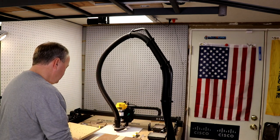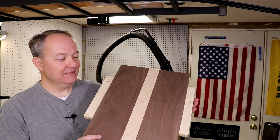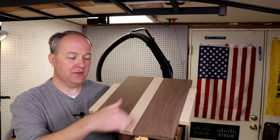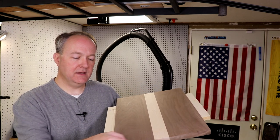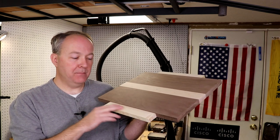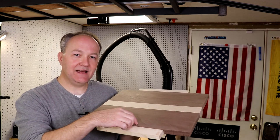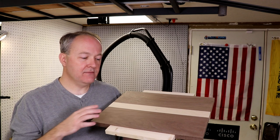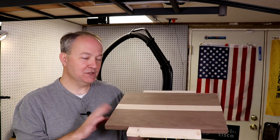I'm at a point where I feel comfortable moving forward, and I'm hoping I don't ruin this beautiful blank that my father made for me. This is a piece of black walnut with a maple stripe down the middle, off the same board. It's very close to the finish size — there's probably about six millimeters or a quarter inch around the perimeter. I've added pine tabs and glued them on so I can hold the material down without it moving. I'm going to use tabs inside the cut to keep the piece from coming loose once the final depth is reached — it worked on the MDF and I'm hoping for the same results with this beautiful blank.